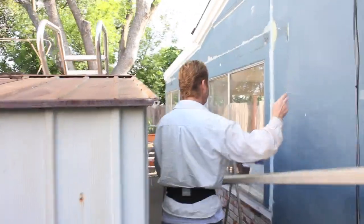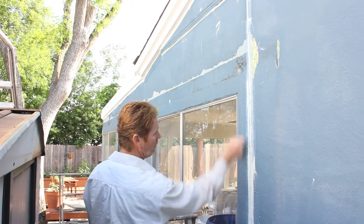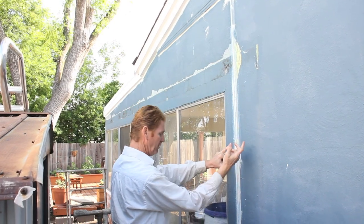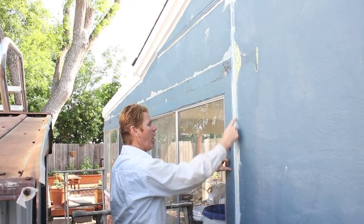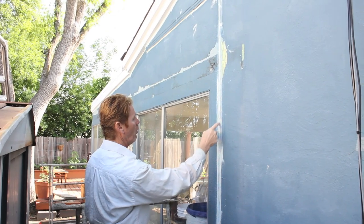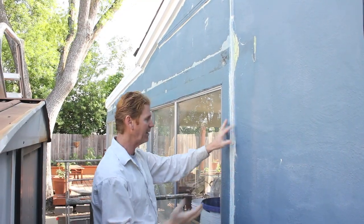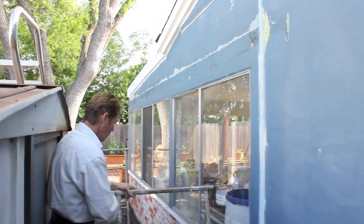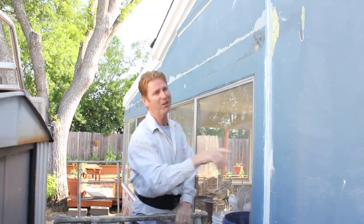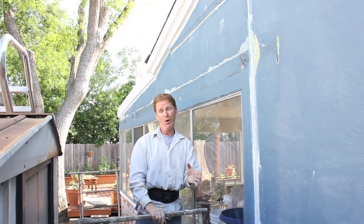Here's an odd thing I found out a couple days ago. Generally I'll put fiber mesh tape over large cracks. I scored this with a razor knife, and these two buildings don't touch — there is a gap here, a quarter inch inside. What I did was put some caulking in here, polyurethane Sikaflex, then fiber mesh tape, then we put the bonding agent over that, just to stop water from going between these two. Certain things you can and can't do — I can't guarantee it won't hairline crack again, because the two buildings aren't connected properly. What you generally do is break the stucco out, put a stud here, lag bolt it together, and put it all back together. This one just butted to itself. We're only as good as what we have to work with.